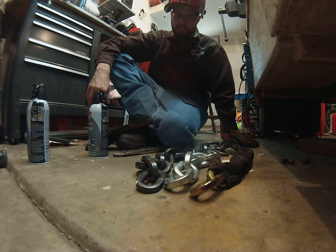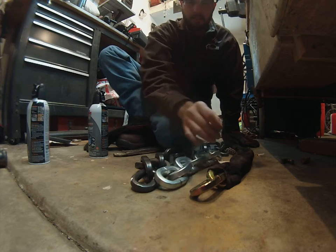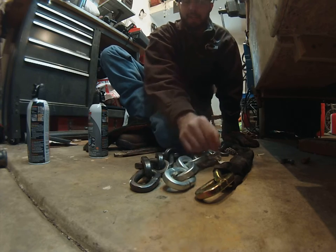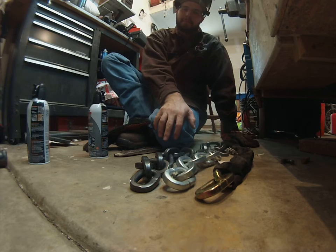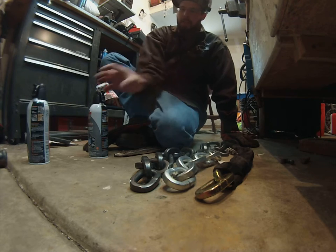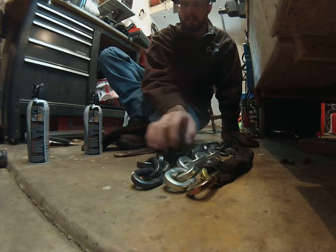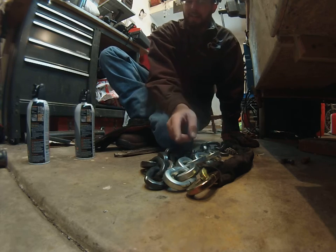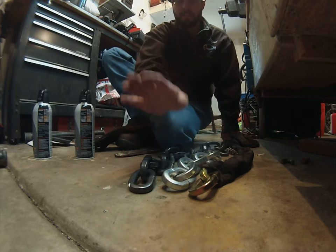Been doing a lot of stuff on security chain, finding out what really works well and defeats the most attacks possible. It's out there in a couple videos where people freeze stuff — freeze a lock, freeze a piece of metal — and then hit it with a hammer. Because it's so cold it becomes brittle, since this is all hardened steel, it would make it break like glass. So I've got a couple cans of air — this stuff's a little pricey — and I want to maximize my use and get all three of these with the same shot. We'll use one entire can just like the other videos online, then go ahead and smack it, and if any of them need a touch-up right before we hit them, we'll hit it with this one too.